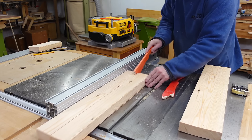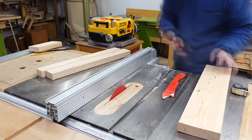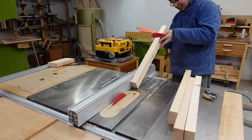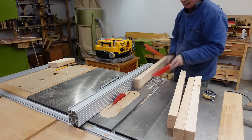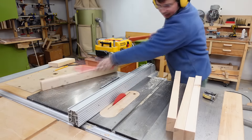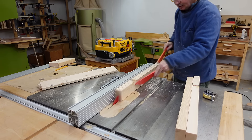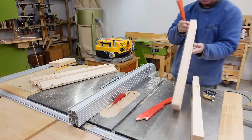I need a lot of boards for this project and I'm cutting those out of 2x4 and 2x6 material, first cutting it to width and then re-sawing it. I'm using a very thin 7¼ inch handheld circular saw blade, and the advantage of that is it cuts very thin and I can cut very fast because my saw is actually not that powerful.